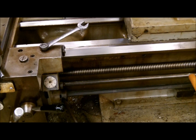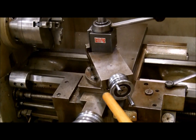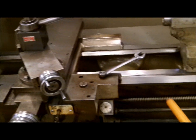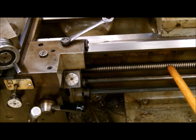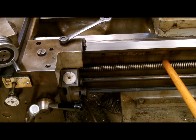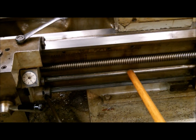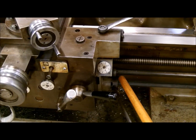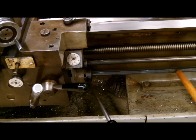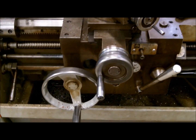The drive of the machine is controlled by the apron controls, which control the movement of the carriage up and down the bed. You have a threading rod — this is the lead screw that allows the machine to thread. This is the driving rod, which sends the power directly to the carriage. And then you have the clutch guide rod, which runs the length of the machine and allows the clutch to be engaged or disengaged.